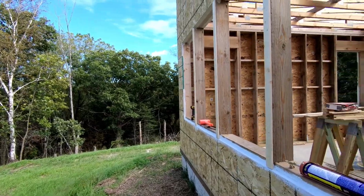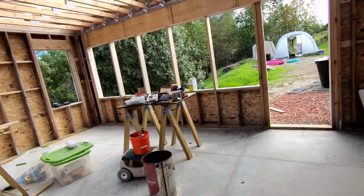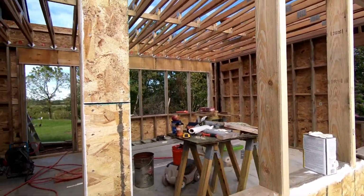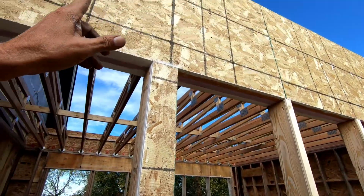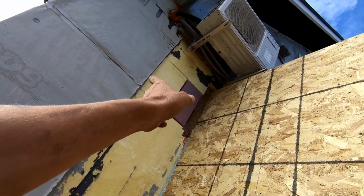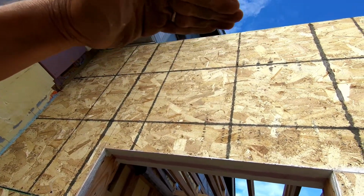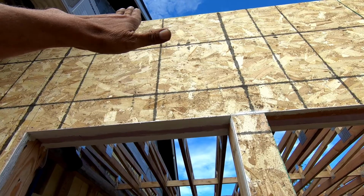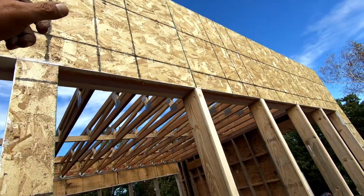Okay, all done. That's it for the sheathing layer. Next is the foam layer, which is an inch and a half thick extruded polystyrene. But before I put that on, there is one detail. I need a 2x4 that runs along the top. I'm going to rip one edge flat and rip the bottom edge with a 5-degree down bevel, and then the foam will go up into that. That's used later for attaching the deck parts.